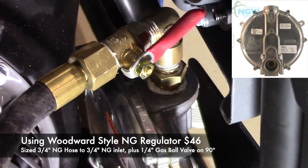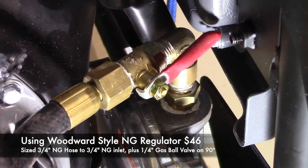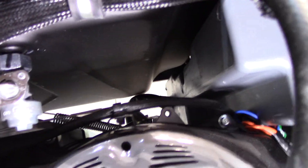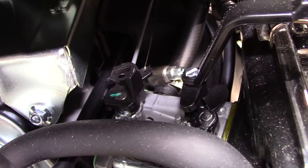The final design involved a Woodward low-pressure regulator. Here we see a 90-degree coupling that was added in order for it to actually fit in the old propane section where the propane regulator sat. You're seeing the spring valve on the regulator, which allows it to prime with the natural gas because you have such a long hose. The carburetor on this generator was already pre-set up to run propane, so I just leveraged it to run the natural gas.